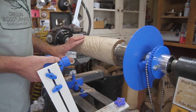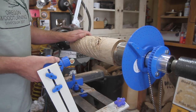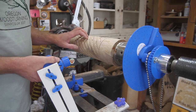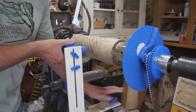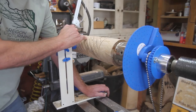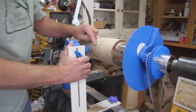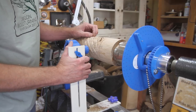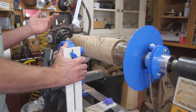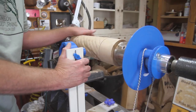Dick had some pictures on his website of people doing it with bottle stoppers, lamps, vases, all sorts of stuff. I did that picture a while back using straight flutes. I would just practice on some inexpensive wood first, because it's key that you hold this down as you're moving it — if it pops up, the bit's not going to run straight. You can see a couple little spots where I fudged a little and went off a bit, but you're gonna sand those out anyway. I have a little taco sander with a foam pad that works great for this.